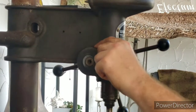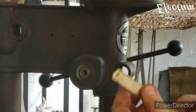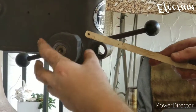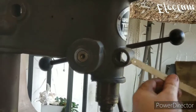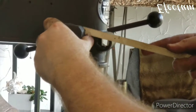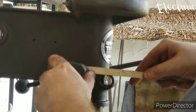And there's some notches that are cutting the housing. So what you want to do is stick something flat. I'm going to use this hacksaw blade behind here so that when we start removing it, the spring doesn't go popping out of the housing and then fly everywhere and be difficult to put back in there. So what I'm going to do is pull this out just a little bit and hopefully get this hacksaw blade behind here.